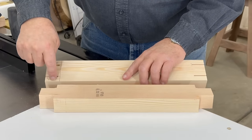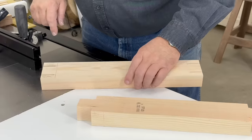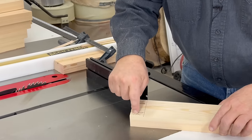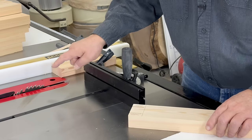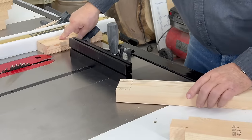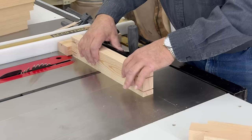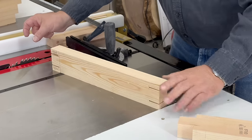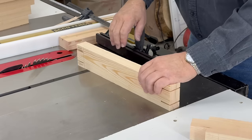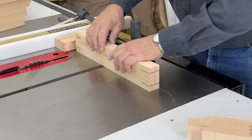Removing this little block that we marked off makes it look like this when we're all done. We've set our blade to the height of this little cutout, which is three-quarters of an inch — so we set our blade just a little less than three-quarters of an inch. I've also put a spacer block to put my stock up against so that when I cut the piece out, it's not pinched between the blade and the fence. If it were, it would bind and spit at you. Let me cut a couple of pieces and show you.